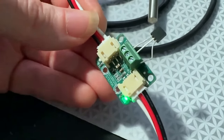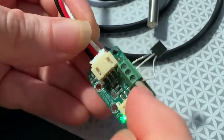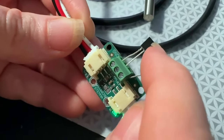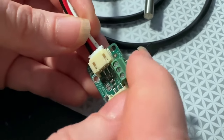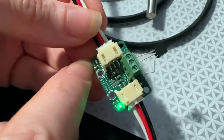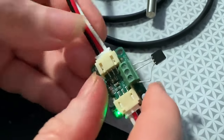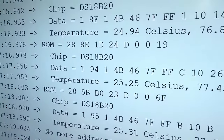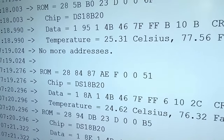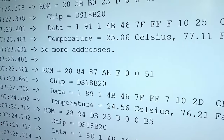Each one has screw terminal blocks so you can easily attach and detach, and you can use it with just two wires — ground and signal only. This one is purposefully disconnected to show you can still read temperature even without the power pin connected, because it's using parasitic power. There's a little red LED that's buffered to indicate when signal is going through, and on the serial monitor you can see all the temperature data — about 25 degrees Celsius for all of them, room temperature, all working.